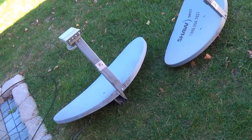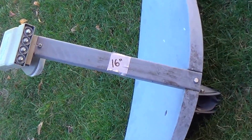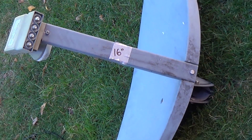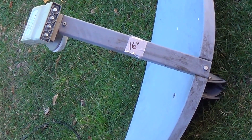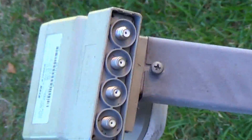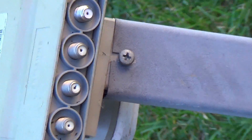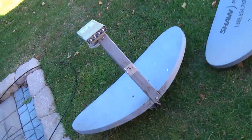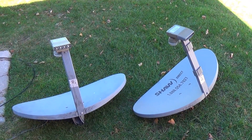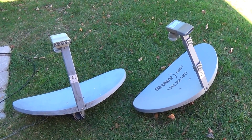In the last three years, this is the second dish I found like this. Somebody has probably pieced it together from parts, or the original arm was bent so they made up their own. I knew something was wrong because the original LNB that came on here, which I've removed, wouldn't fit on there properly — the hole for the screw was also in the wrong location. Anyways, I hope that helps. Take care. Any questions? Just leave a comment and I'll get back to you.